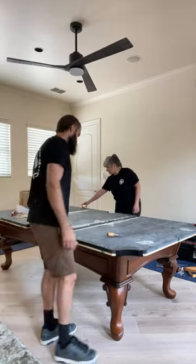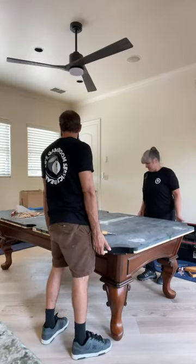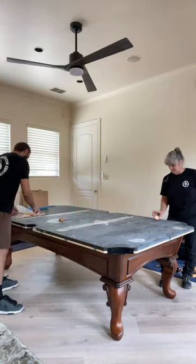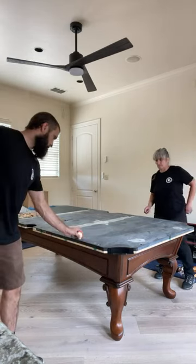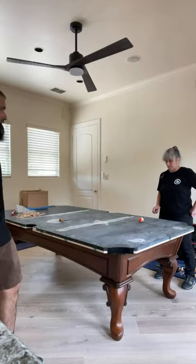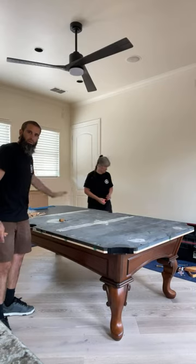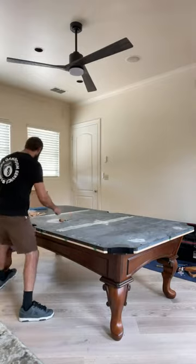We're gonna move to the last one. And it may take you longer to roll and everything, only because I've been doing this for so long, so I just know exactly what to add. So roll that one and see what it says. And this one is probably going to tell us that it's going that way, but it's not perfect. So ultimately, when we started, the table was sagging towards the middle a little bit, and we just raised the end up. Raise this one up, raise this one up, and then raise this one up, and it made it perfect. Okay. So we're done.